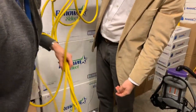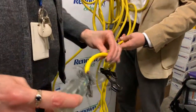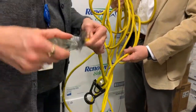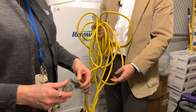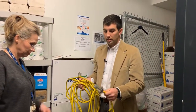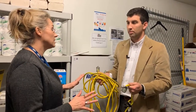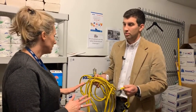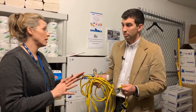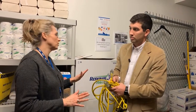And wow, this is probably an extreme situation. We'd never want this to happen. But a lot of times you get this type of fraying when you've got a constant bend in the cord. Okay, so let's say I'm one of your employees and I have a cord that looks like this, and I bring it to you. What would you do with it? Well, I'm going to have to take this cord completely out of service. It's unsafe, it's a fire hazard, and absolutely no way can we be able to use this. And I need to have this disposed of immediately so no one else uses it.